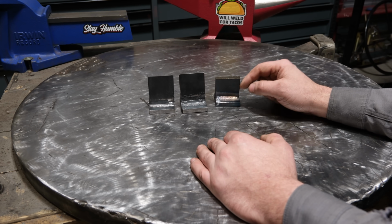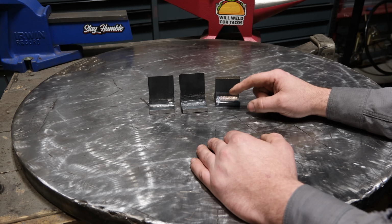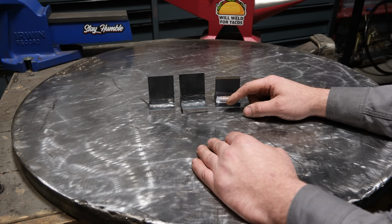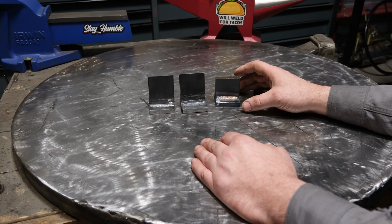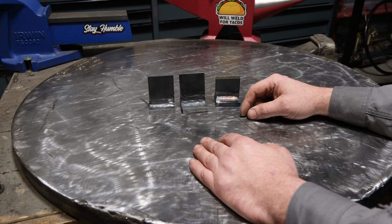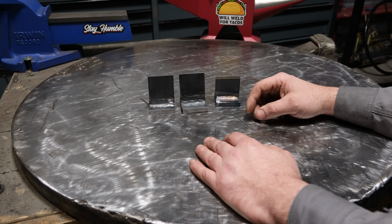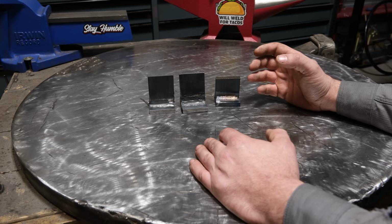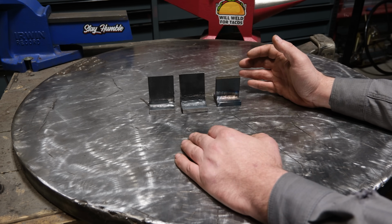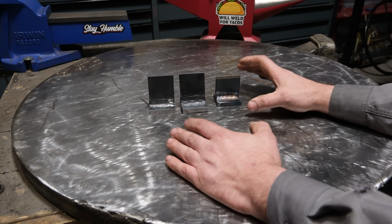Now, I'll be honest. I've never really used JB Weld to much success, primarily because it seemed like everything I needed to use it on was exposed to high temperatures, and it simply is ineffective at that. So maybe some threads that are screwed up, you could retap and put a bolt in, but if that happens to me, it's always on something that will burn or liquefy that epoxy, and it's just not usable. So maybe you have far better uses for JB Weld. I mean, no doubt I use it occasionally, but when you can weld, especially TIG weld, you don't really need epoxy like JB Weld for the most part, okay?